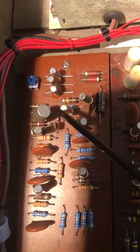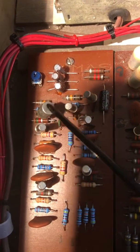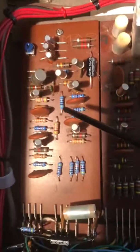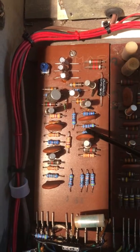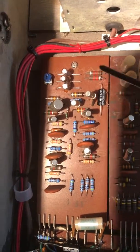These units have germanium transistors — this is a 116 and this is the 351. They're sometimes noted to go bad, but none of mine are bad. I did notice however that a lot of the resistors are way out of spec. Some of the 4.7k resistors are all the way up to 7k, and I replaced many of those.